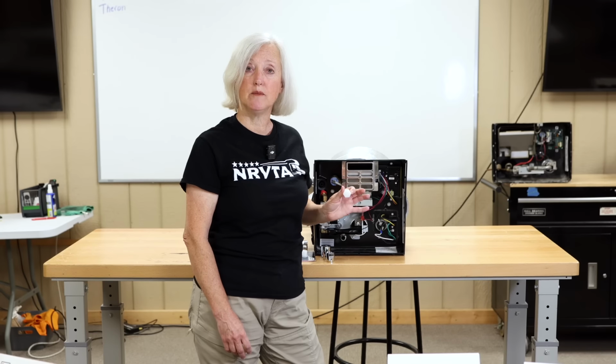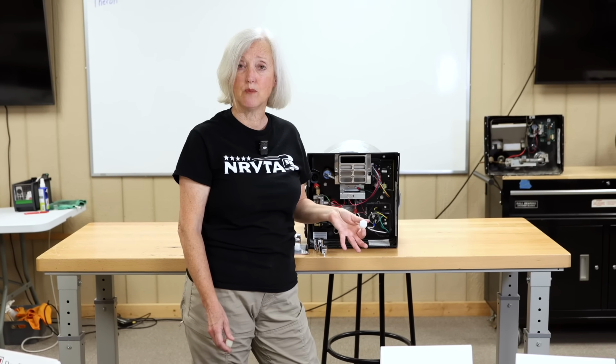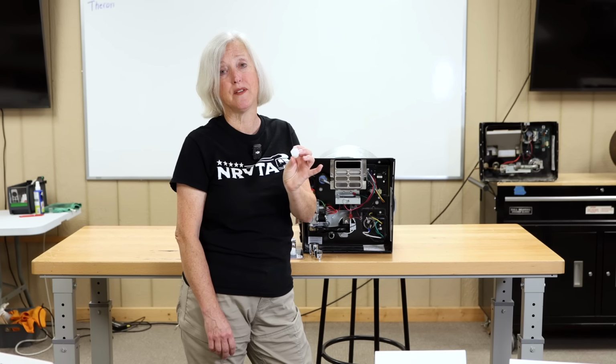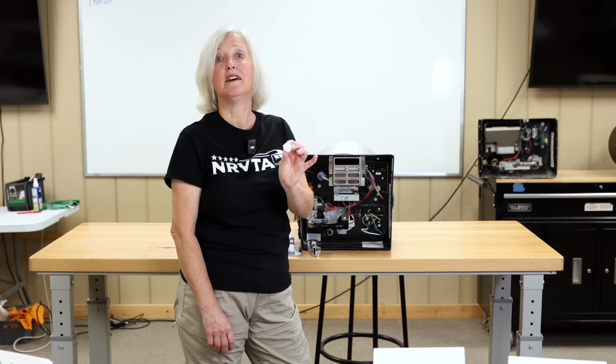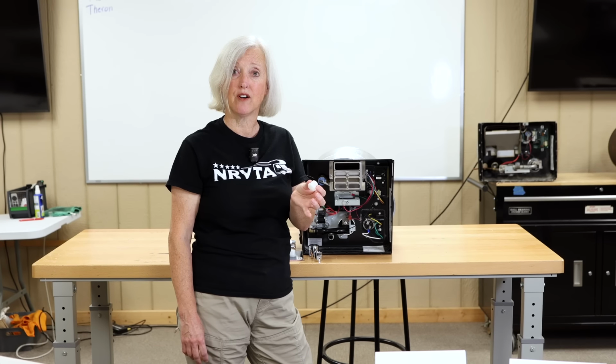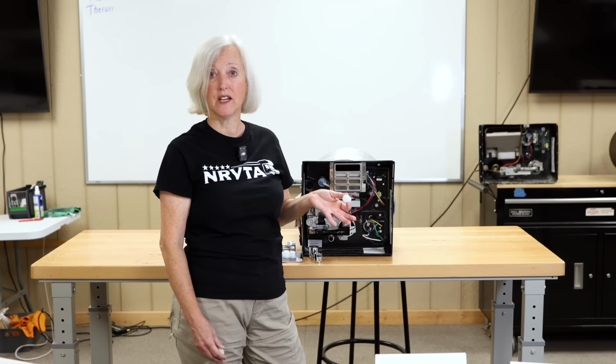If you can never get it out, you can't ever drain it, you can't ever winterize it, and you can't ever sanitize it. You've really damaged what your water heater can do. Also, people will say, I could go to the hardware store and get one that's plastic, and it's the same size, but it's not rated for the water heater. It has to be the one meant for the RV water heater, because that's the only one that's going to provide that additional layer of safety.